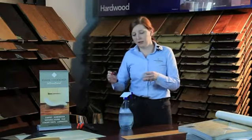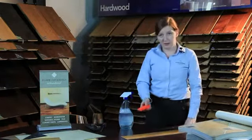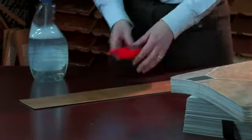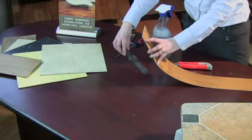If you want to save the trim, the cleanest way to do it is simply with a flat head screwdriver — just pry it right off. Next you're going to take your utility knife to your vinyl and cut it into about 12-inch strips. At the same time, you're going to take your scraper and use that to really pry up that vinyl and to scrape that adhesive off the bottom.